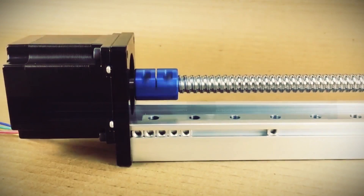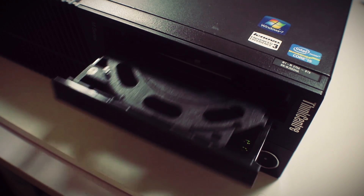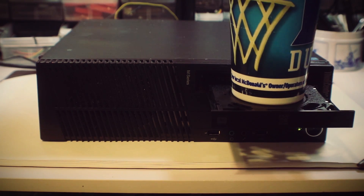Narrowing it down to its most basic components, we have the melting and extruding mechanism, and the motors and rails that move it around. The linear rails are basically a motor that moves a platform linearly along guided rails. Luckily, you can find these sliding mechanisms littered throughout computing history — in scanners, printers, and optical drives. Optical disk drives found in desktop computers, old DVD players, or gaming consoles had a motor and rail mechanism that would slide the tray — or as I like to call it, the cup holder — in and out.